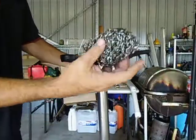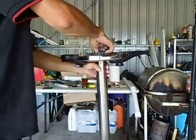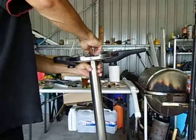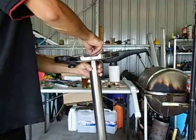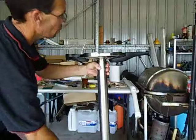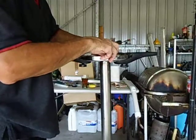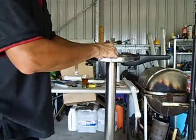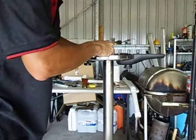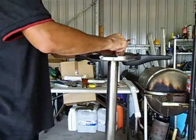The last thing I'm going to put in is another pot scourer — they're all stainless steel. I'm just going to put that in. That prevents the ceramics from falling back into the boiler. Just press it lightly in. I've also got a piece of copper wire with two little holes in it, just to make sure it doesn't drop out. Tie it together.